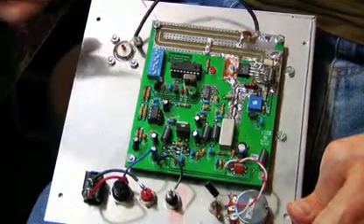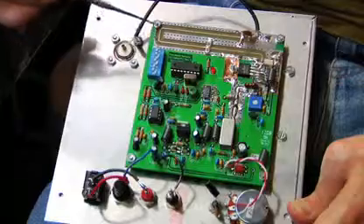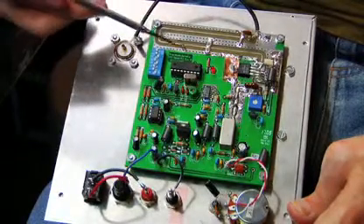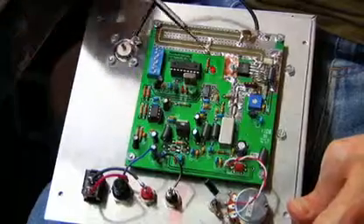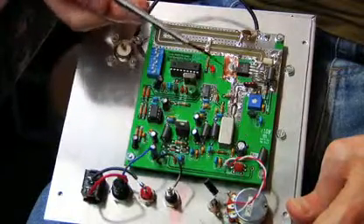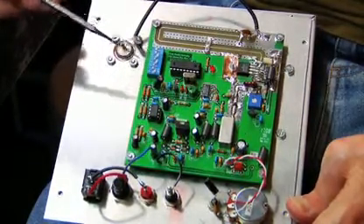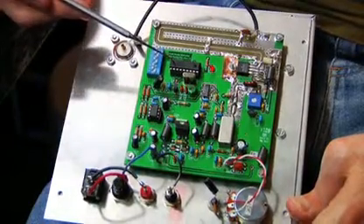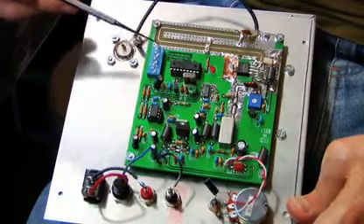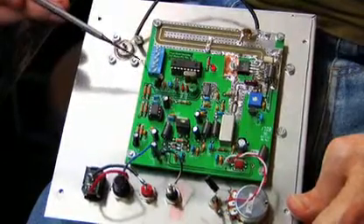What I have here in front of me is a 10-watt PLL transmitter that's been fully assembled. PLL stands for phase lock loop controller. There's a particular circuit — pointing right here — which actually controls the frequency and keeps it exactly on the frequency that's been programmed by these series of switches, called a dip switch. It's an eight-position dip switch, which is read by a microcontroller PLL controller chip. It reads this data, transmits it over to this chip, and basically programs it for the specific frequency that's been set.